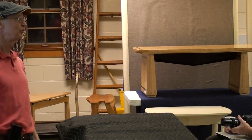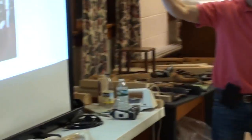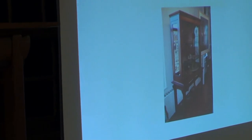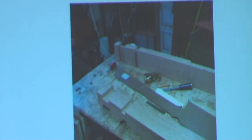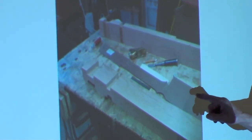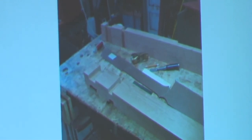I've got a lot of things to show you — probably too much — so if it runs too late just stop me. This is the display case I made for the guy who also has the conference table. These are the long stretchers and here's my pattern. You want to start off milling lumber really well — the better you mill lumber, the better your joinery is going to come out.